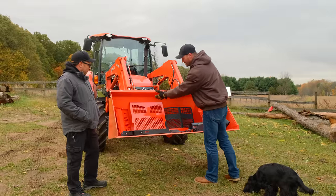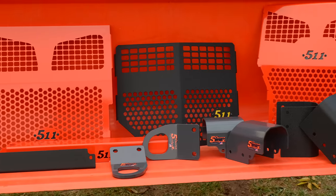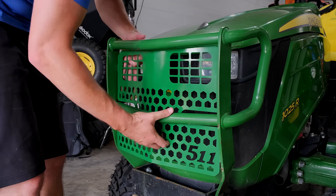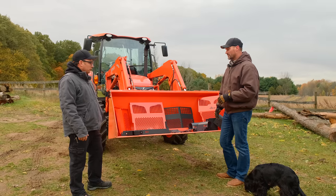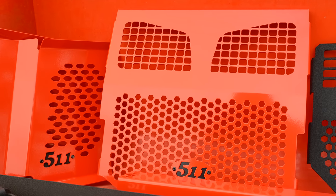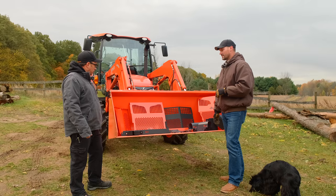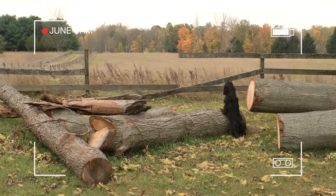One of the impressive things is how close the color match is. This is a Kubota, but we did a John Deere as well. I thought the black actually looked like a nice contrast, but the green match is really good too. Are there any other colors? Just John Deere green. We also have chassis gray for the grille guards to match the chassis on Kubotas. The powder coat is so clean and smooth — it's actually a five-step process: cleaning, media blast, outgassing to remove impurities from the steel, a zinc-based primer, and then the final finished coat.